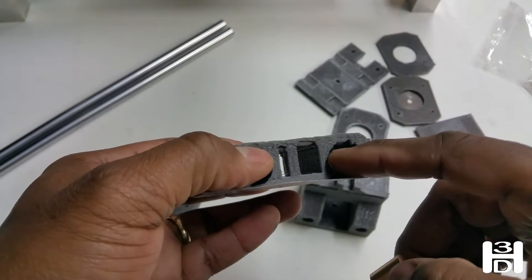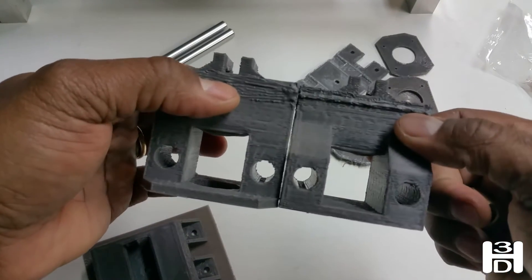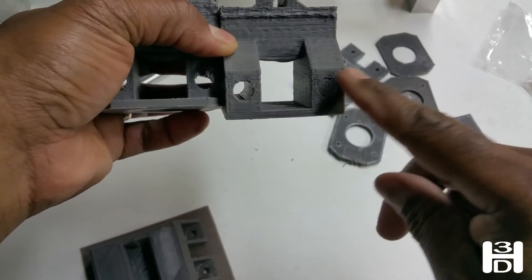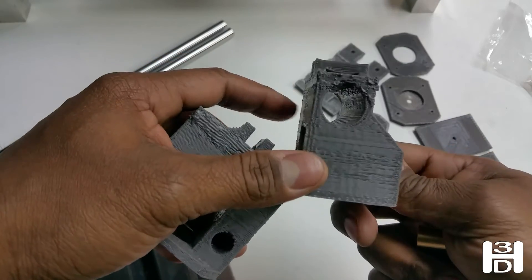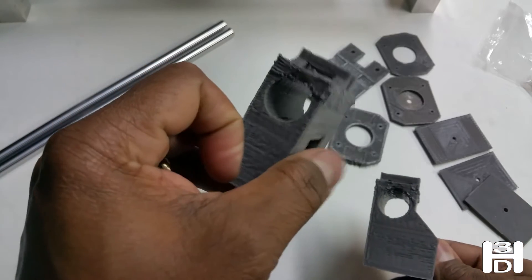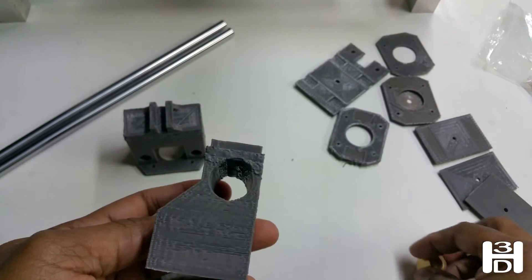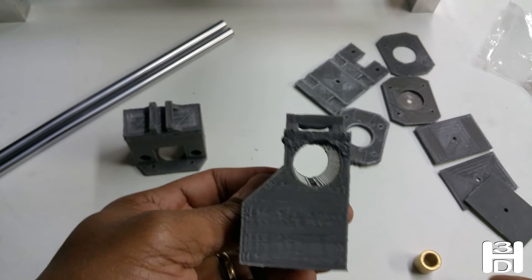What I'll do is clean all of these up, because right off the printer, none of these holes actually fit the bushing. Because they are printed flat and the tops of the holes are all overhangs, there's too much drop down even though it bridges — it doesn't make it perfect. So I'll clean these up to make sure that the bushings can actually fit, then I'll work on installing this onto the Y axis.